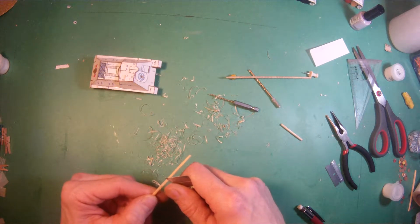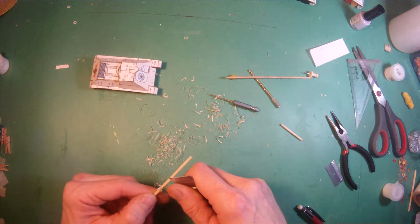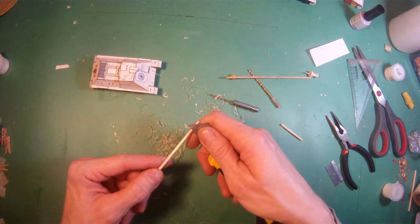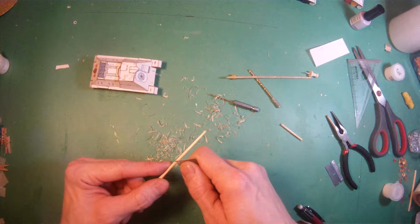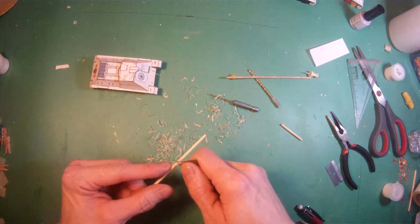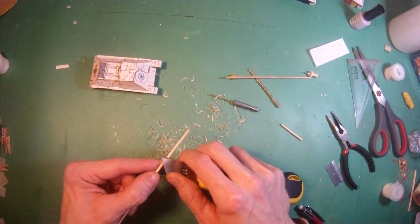And you can back cut like this, but I don't suggest you cut very much this way. Especially if you start back here, it's easy to slip under the grain and then you can lift off a whole side. So short strokes towards the back until you've got it at the shape you want it. And then you can come forward again.